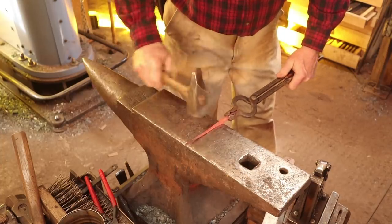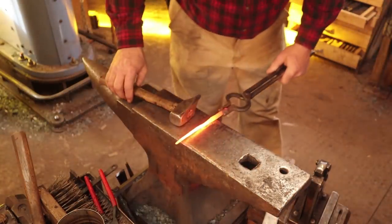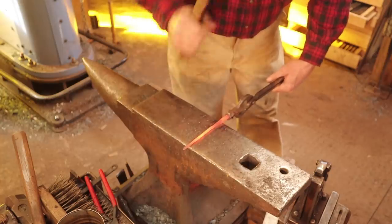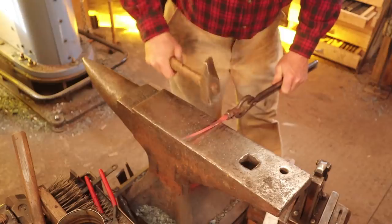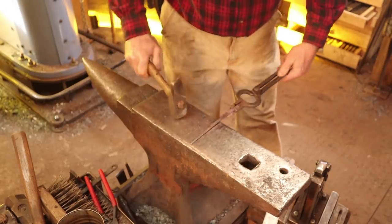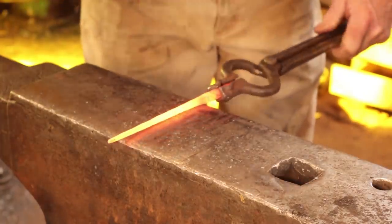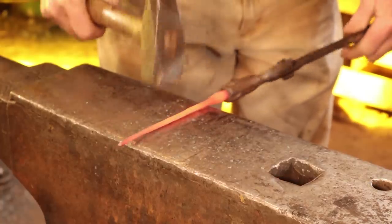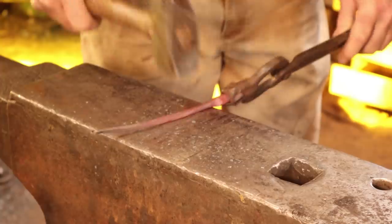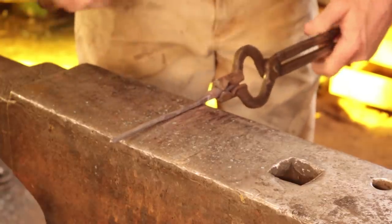The end of this is just fine as far as I'm concerned — I just need to work on this transition point up here. This cools off fast, there's a lot of back and forth to the fire. That's getting very close to what I want. I just want to get it established and knock the corners down. I like these octagon — just personal preference. I'm not going to worry about finishing that entire scribe end until I've done the blade end.